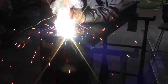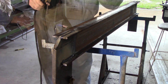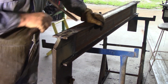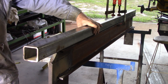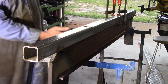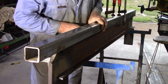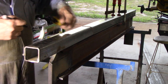I'll run down each side of this. The I-beam I got for this project was a little bit smaller than I actually wanted, but I got it at the right price. I also had a piece of SHS with a 5mm wall left over — it was 76mm, the same as the width of the I-beam — so I'm welding that along the bottom. The bottom of the I-beam is mainly going to be in compression, so this SHS will reinforce it a lot. It will move the centre of force down a little bit, which puts more tension load on top, but the I-beam is designed for tension load anyway. It won't be a problem, and it should be a lot stronger.